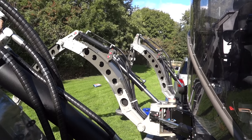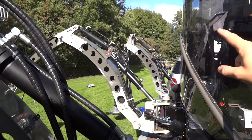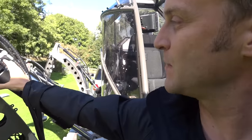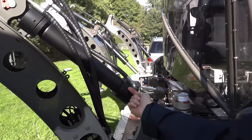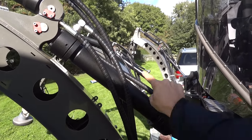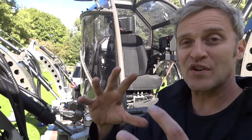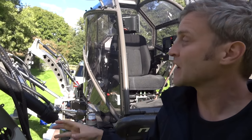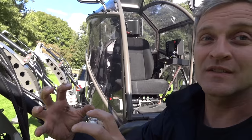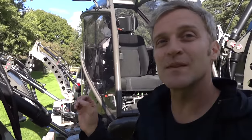I've just fired up this middle leg and you can see as it raises up there's a little bump — it comes down and as it comes back the other way there's a bump again. That's basically air trapped in the top of the cylinder, and it's quite tricky to bleed out on this machine. These femur cylinders have air trapped in the annulus side — effectively air in this joint here, sat at the top of the cylinder behind the piston. What should happen is the fluid under pressure should compress the air to nothing, dissolve it into the fluid and drain it out. But because it's under a falling load the fluid decompresses and the air expands again inside the cylinder. I've never been able to bleed the upward stroke successfully — it doesn't really affect operation much, but it is a bit of a no-no in hydraulics.